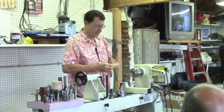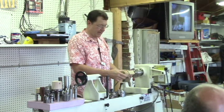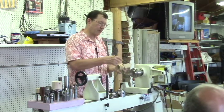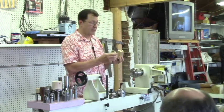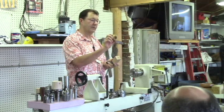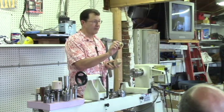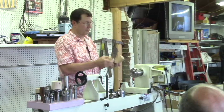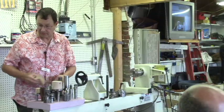This is the other end of it, the jam end, and then you could just spin that around and set that in the chuck and finish it off. So I actually pull it off of this one first, part it off, and then push it into your jam chuck. That allows you to use that material right down to probably the last half inch or so of it, and you get a lot less waste that way. So jam chucks, and little alternate jam chucks, those are really helpful.